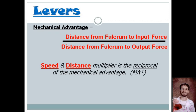And for the exact same reasons, it gets flipped over if you look at the way that things are moving and you do a bunch of triangular stuff with geometry. It ends up working out this way because, remember, this is distance and not force. So it ends up making those similar triangles, and the triangles of force are the same exact ratio as the distances on the two ends of the lever. Well, not always the two ends of the lever, as you will see.